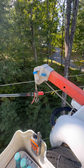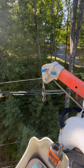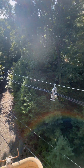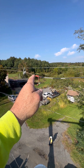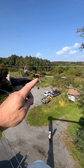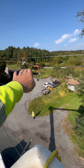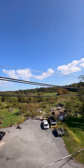Now it's going into the turn — you can see all three conductors. This is 477, insulated wire — I believe it's rated up to 15,000 volts. One thing I wanted to point out on the gator block: those tails that are hanging — if those tails were not there, the block would want to rotate 360 degrees. Those tails basically keep everything nice and flat.